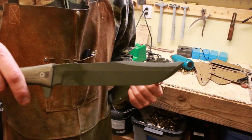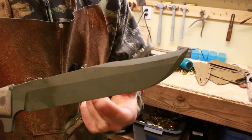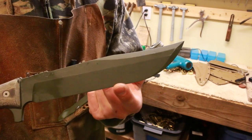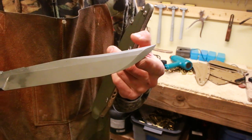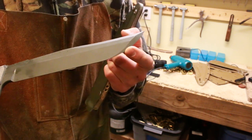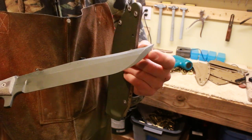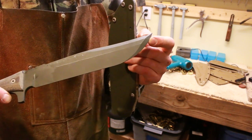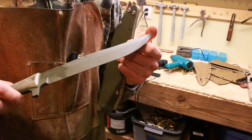You can see, hopefully in this picture, that I have a straight grind geometry on the major part of the blade, coming out to the point. Then I have a 40-degree basically zero grind edge belly on this blade, and then a false edge. So you're going to have a really strong point here — this is what Crocodile Dundee would have needed if he's actually going to throw a bowie knife without worrying about busting his point off.